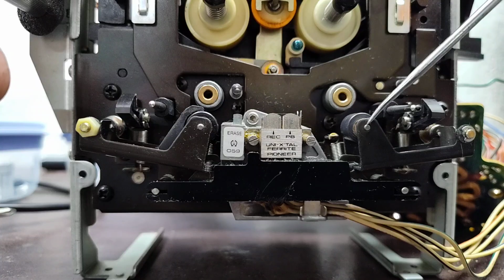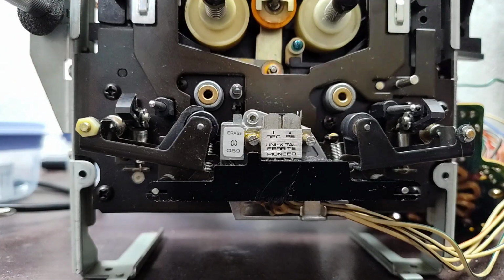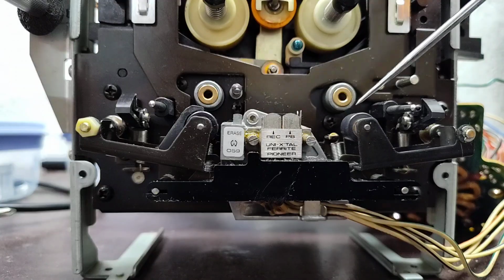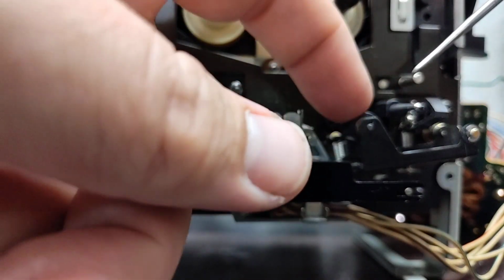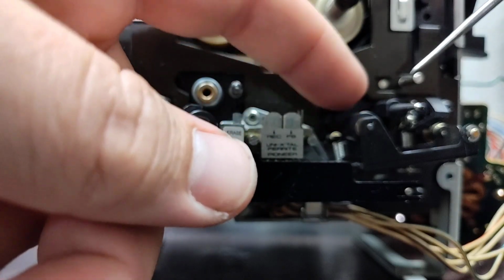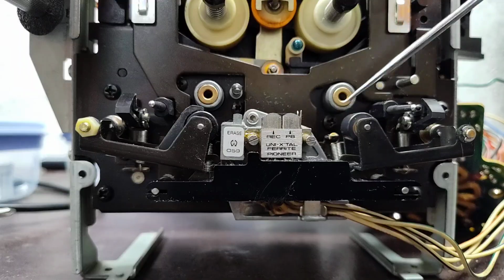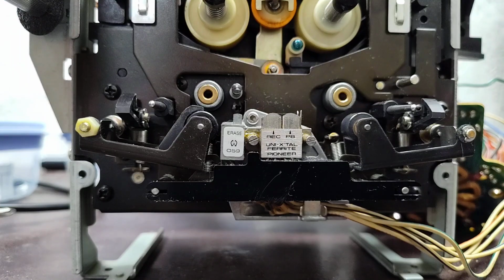But you have to press them in and out. So you need to very carefully punch this shaft through so that you can get the old one out. The new one has a nice fancy bearing and stuff like that, so that's nice. But if these were soft, you could refurbish them maybe, kind of do them up that way, but these ones are absolutely hard as a rock, so I don't really trust doing that. So we'll start by doing this side first.